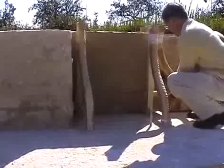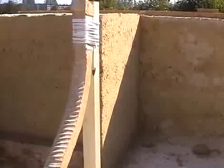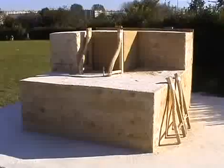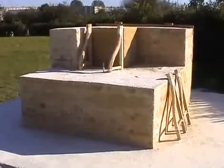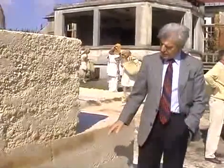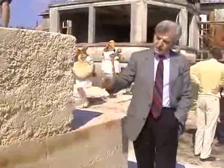The synthetic limestone looks like a natural stone. We observe no trace of wood grain. 4 blocks have already been made. Jozef Davidovich presents them. The 2 large blocks weighing up to 4.5 tons, containing most water, have given smoother surfaces. The 2 small blocks weighing up to 1.3 tons, the least wet, take on rougher surfaces.